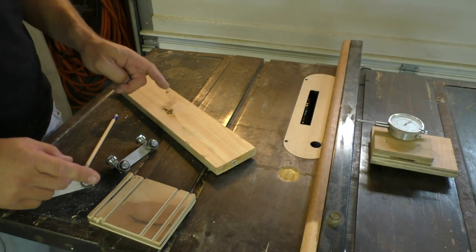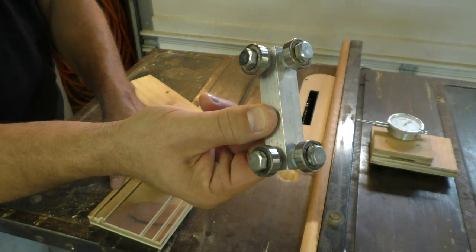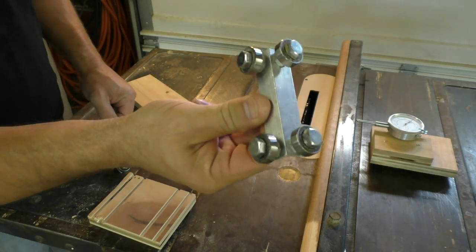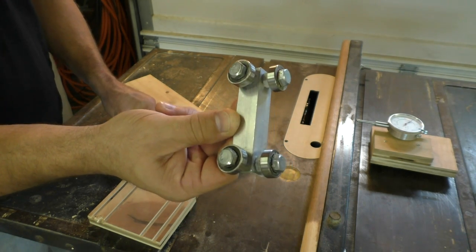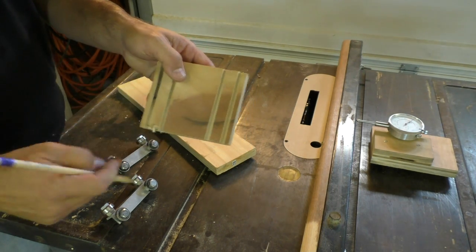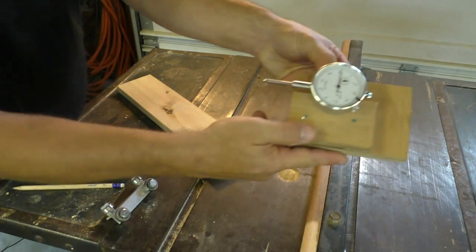I just want to pause here for a second and show you what I'm going to do. In this next segment I'm going to be cutting the groove to mount these bearings — this is just a roller skate bearing, there's four of them. It's mounted on the same three-quarter angled aluminum, the same bearing used in the claw machine. I know from previous experience that this edge to this edge needs to be 0.825 inches, and you're probably wondering how on earth do I get a 0.825 inch cut with a table saw.